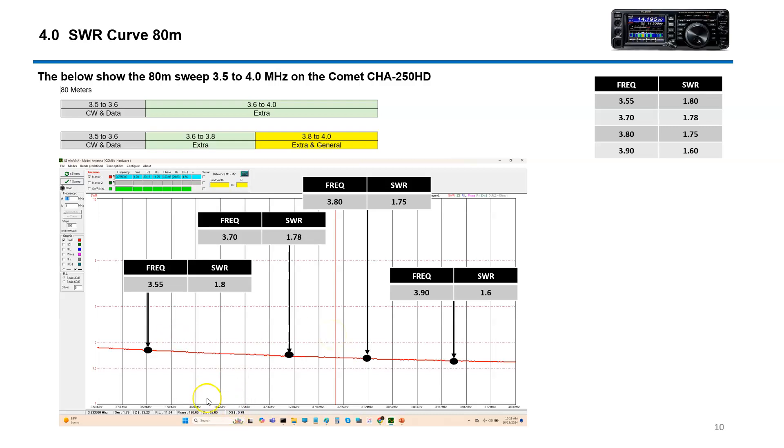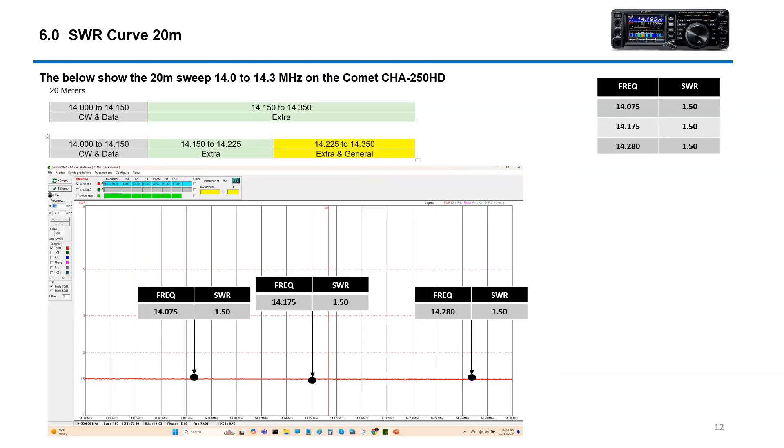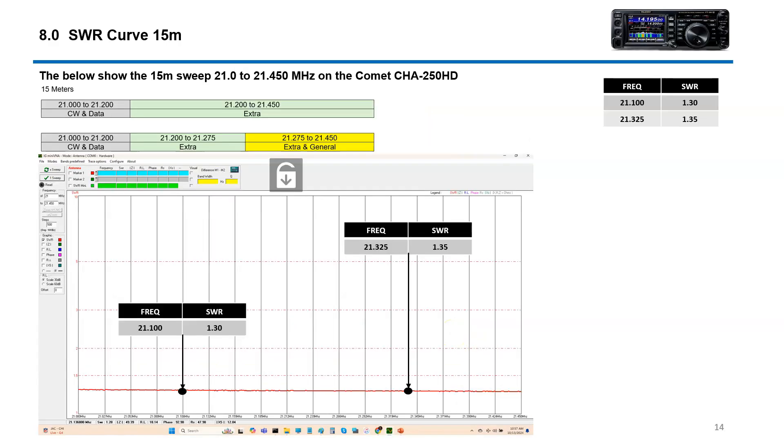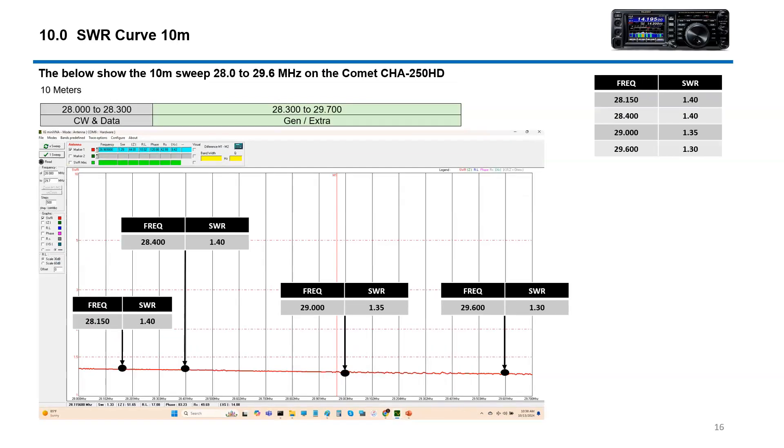Just a quick overview of each individual band. On 80 meters, I normally play around 3916, which gives me an SWR of about 1.6, but there are some losses I'll talk about in a minute. This is the 40 meter — pretty much flat across, though there are losses here. This is the 20 meter, and the 17 meter, 15 meter, 12 meter, and lastly 10 meter. Overall, it's very, very usable. I don't even have to use my antenna tuner, so that's just one thing I don't have to deal with right now.